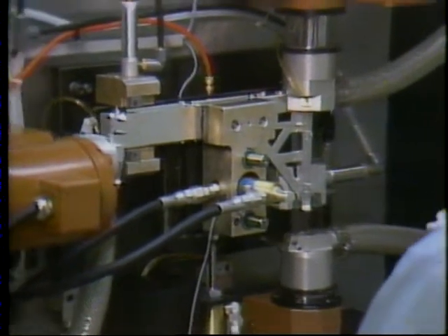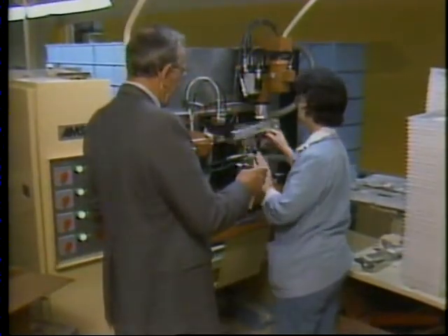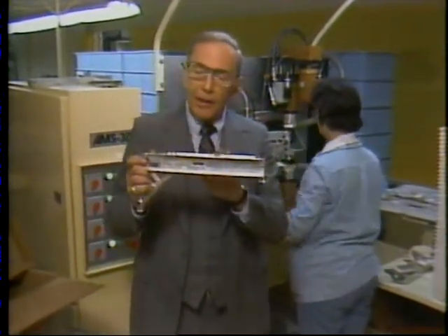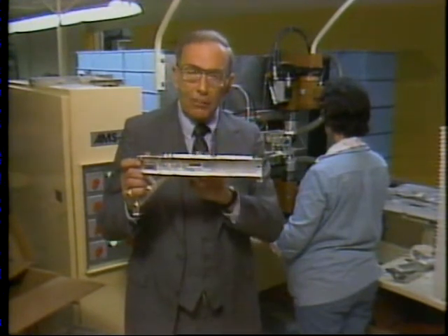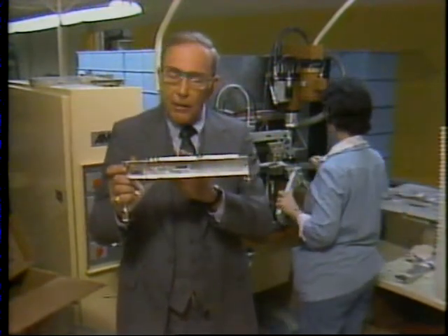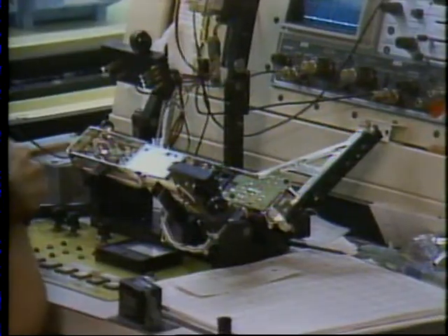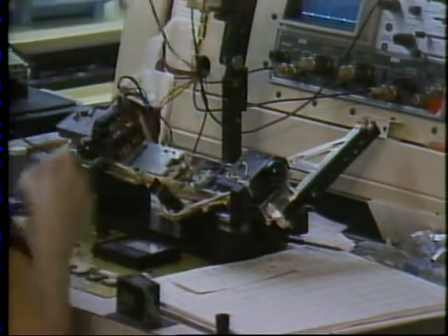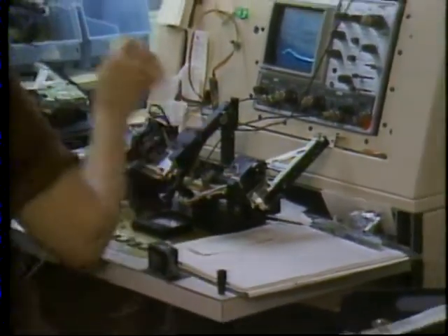We are now beginning tracking arm build-up. The arm assembly is die-cast zinc. This precision boring device is making sure the assembly's fastening holes are exactly aligned. The arm is a very complex device — it must house not only the stylus cartridge, but also the sensitive pickup electronics. When the arm reaches the final testing station, over 80 distinct components on three subsystem circuit boards have been assembled into it.